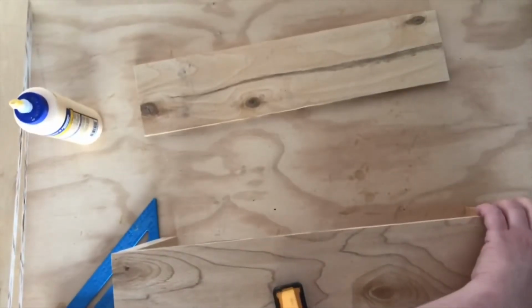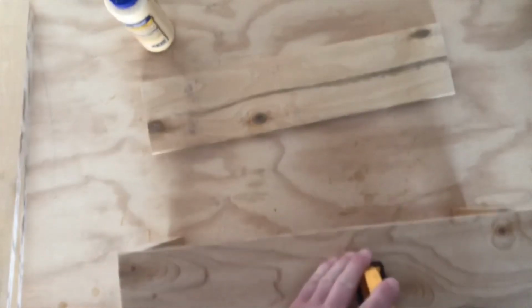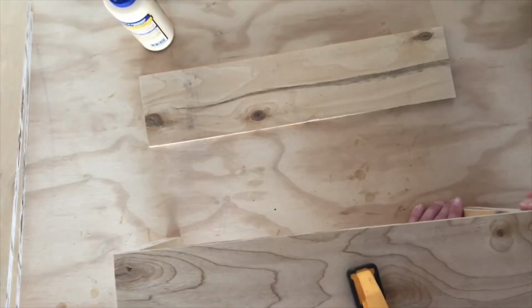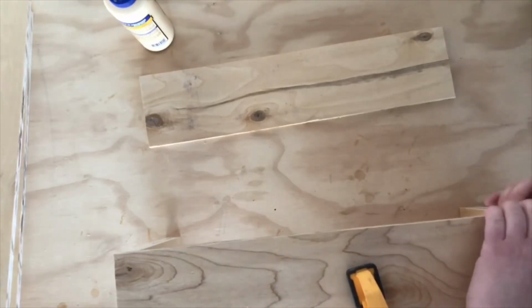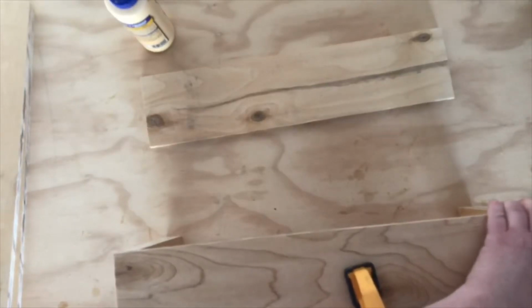So, anyways, that's how you do that part. Then you loosen your clamp up so that you can fix the other end with some glue. Just kind of snug it up until we make sure we're square still. Usually I mark which side I want to be the top or the bottom. Doesn't really matter at this time, but it's good to think ahead. Best edges and stuff. Let's throw that on there a little tighter. There we go.